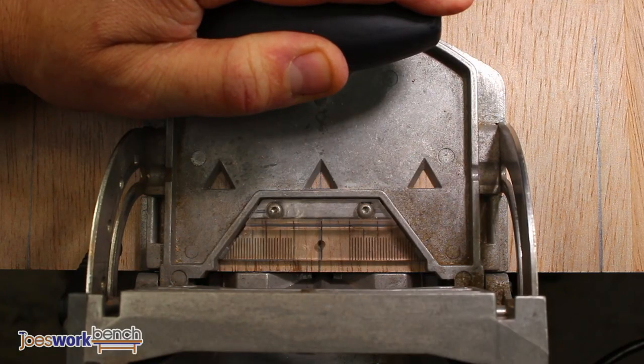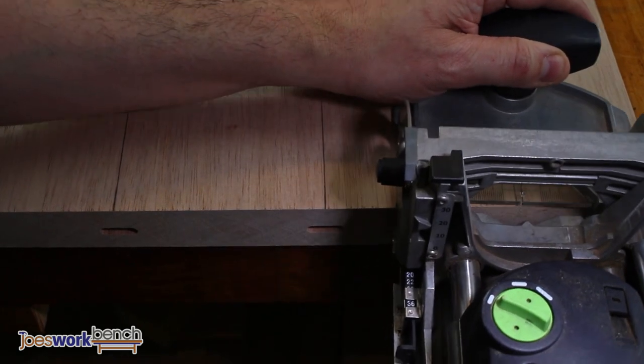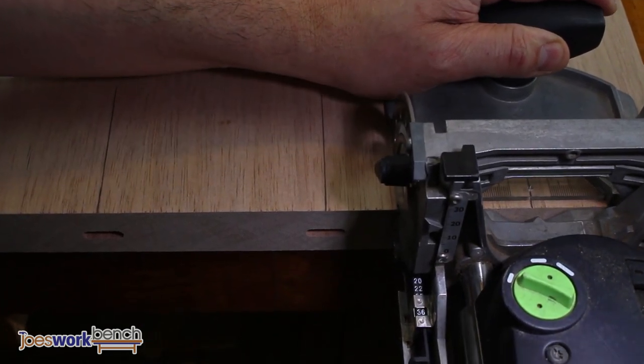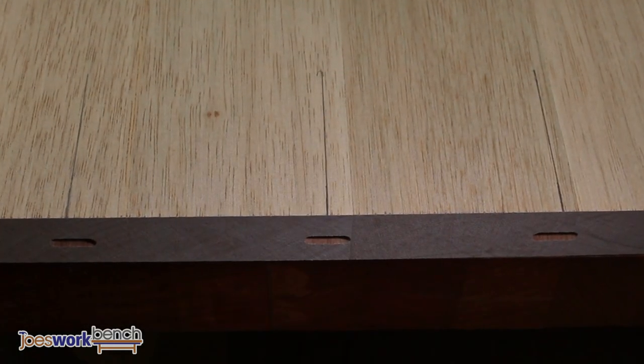All the joinery was cut with a Festool Domino. They are a huge time saver and really help with alignment. When testing out my joinery, I used dominoes that I have previously sanded and coloured in with a Sharpie. The cabinet sides were inset by about 2mm.